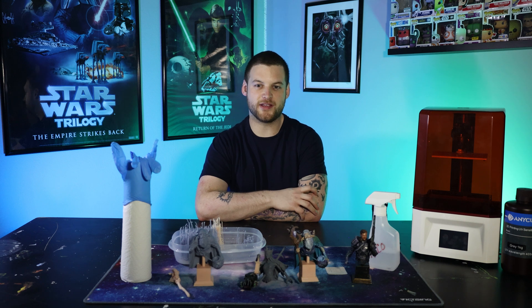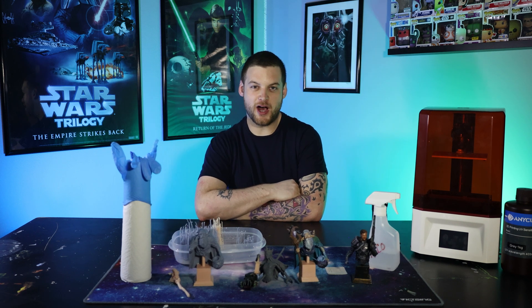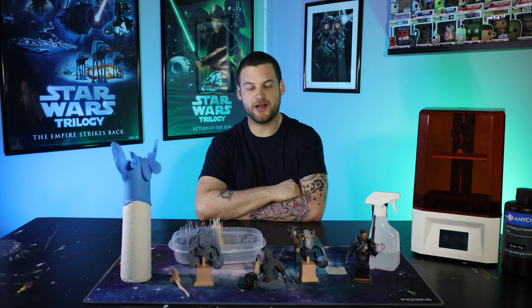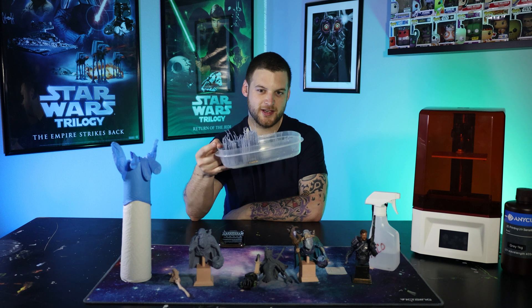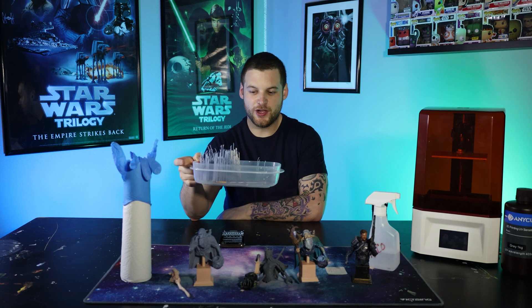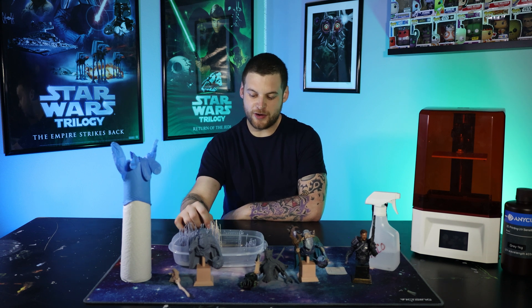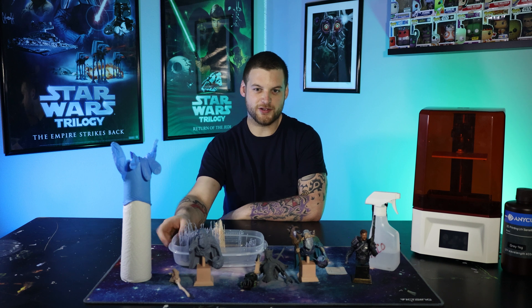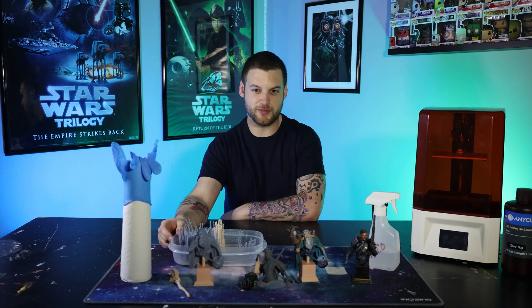That way in the middle of your job you can place them down and do everything safely and cleanly. Thing number three: if you're printing in a garage or a room in your house, you're going to want a dedicated trash can for all of your resin bits and pieces that are uncured. Typically these just get thrown away, which is really bad. You want to put them in a trash can that you can leave outside in the sun, let it cure, and get rid of those harmful chemicals. Otherwise you're building up really terrible chemicals in your house that you're breathing in.